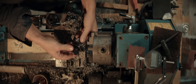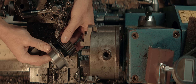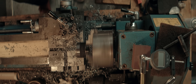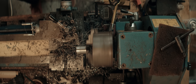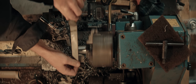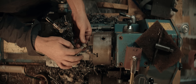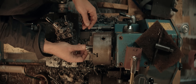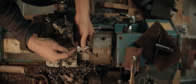I've removed the old belt drive pulley from the crankshaft assembly. First operation is to make something so that this will fit on here so that I can mount this. I can't find anything suitable, so I'll have to sacrifice this pulley — this will become the new extended nut. I need it to be longer than the previous one because the pulley is thicker. I'll just square it up in the sander and then drill and tap it from this side.